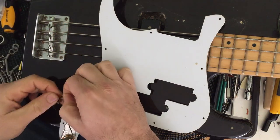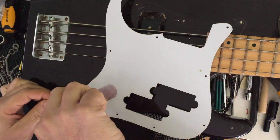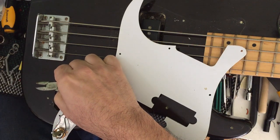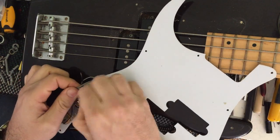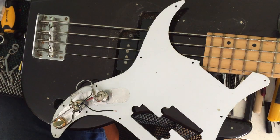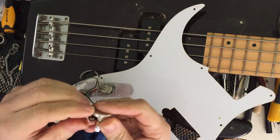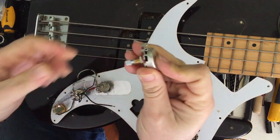And get rid of this junk here. Let's pull this ugly tape off. It's brittle anyway, it's just falling apart like plastic. Two wires tied together with a bit of tape around it. That's nice. All these ground wires are going everywhere. That ground wire won't be necessary because all you have to do is bend this pin on the pot up towards the body. So all I do is bend it down, bend it back and it makes contact with the body like so.